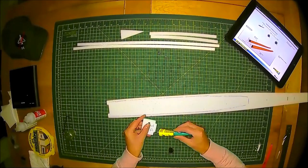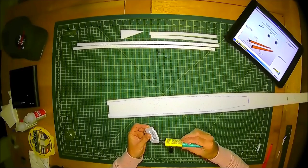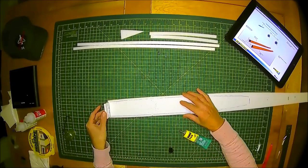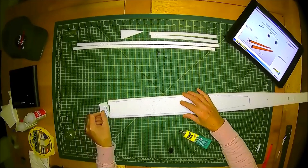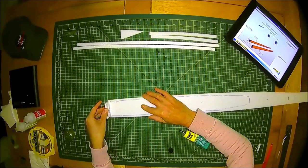Step 1: as you can see on the belly panel, mark out from the plans where the side reinforcers are due to go. Add a small amount of glue on bulkhead number 1, offer it up, pull it back and forward a couple of times just to allow the glue to get tacky and give a better bond.